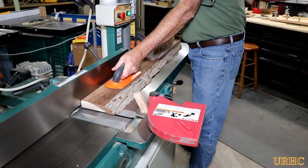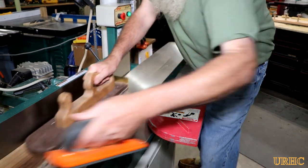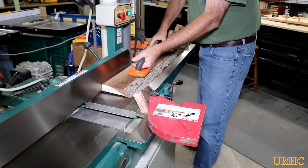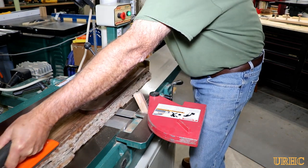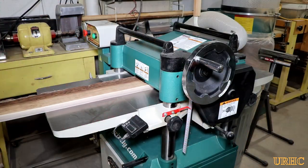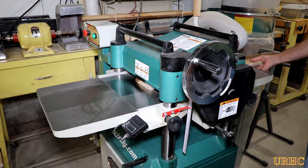I had to flatten one side of it — you have to be really careful here. I had to take the guard on the joiner and put a block of wood to keep it out of the way so I wouldn't damage the natural edge going through, because you can knock that bark right off with the spring-loaded joiner safety cover. Then back over to the planer to get a nice flat parallel surface and bring it down to the three-quarters of an inch I was going for.